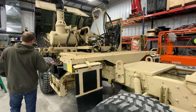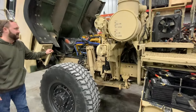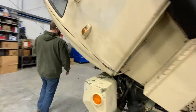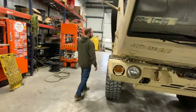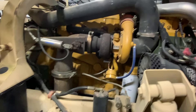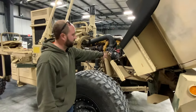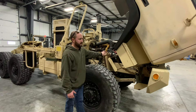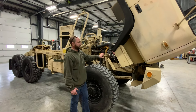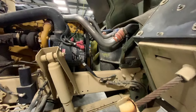This unit will get all new battery cables, batteries, full service. It's an A1 truck with the 3126B Cat engine that produces just shy of 300 horsepower. The nice thing about the 3126 is — we'll walk over to the other side — it has a factory exhaust brake. This engine is super clean. It's a factory pack brake exhaust brake controlled inside the cab; that's one of the nice features on the 3126 and C7 trucks. Being that it's not a C7, this truck still has the original 100-amp dual voltage alternator. It's a newer A1 truck — you can tell because it's a full serpentine belt engine.